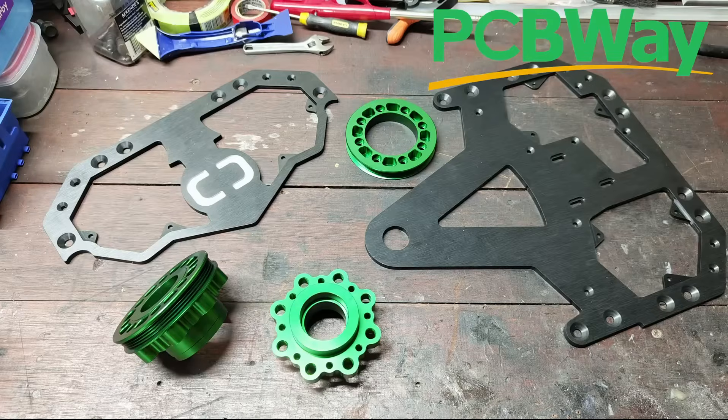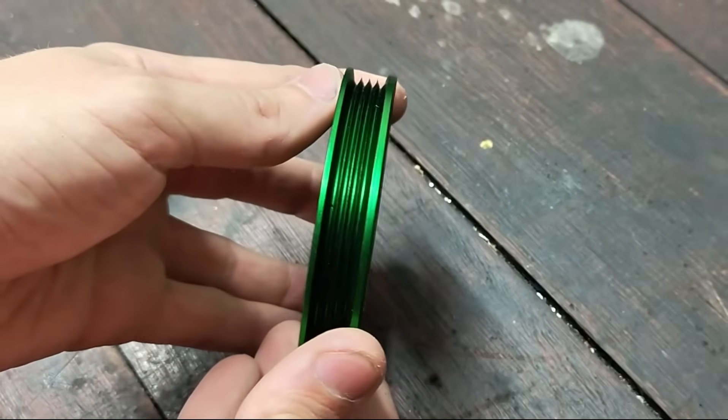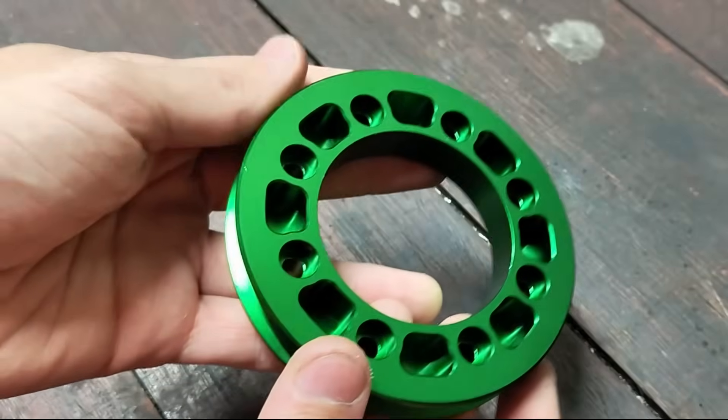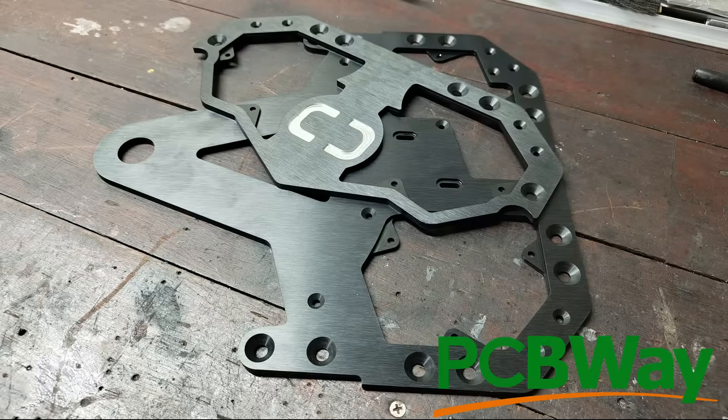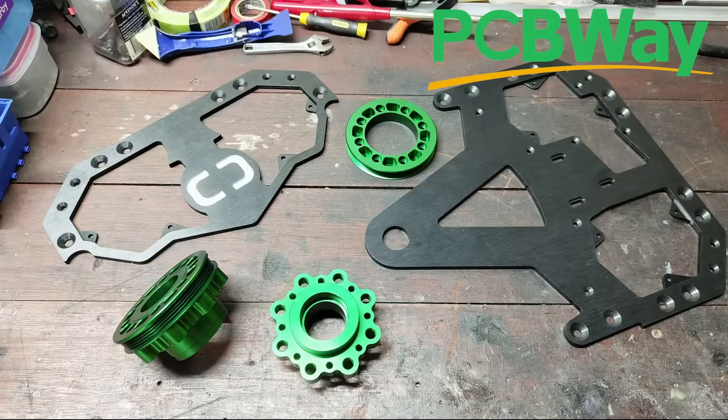The parts for Obliterator have been provided by PCBWay. Each piece was made of anodised 6061 aluminium without bead blasting to allow the machined finish to show through. Bearing fits were within specification and all parts fit together nicely. I requested the broken link logo be post-machined after anodising to show a shiny finish, which turned out very well. Similarly, the J-profile pulley grooves grip the belt and should transfer plenty of torque to the weapon. All parts are fit for purpose and should be working in the robot before long.